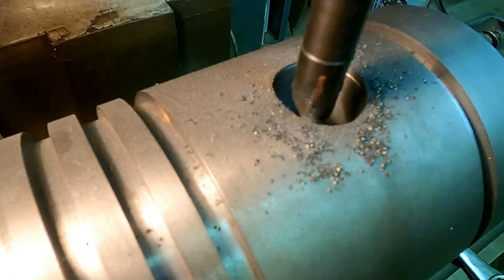That's all the time I have for this video. Got the holes, bosses drilled out there to the dimension I need. The wrist pin's not that big, so there are brass bronze bushings that go in there that the wrist pin actually rides on, so we'll be making those in the next video. But for now, I think one of the hardest operations on this piston process is behind me now, and I'm glad, and I've come out learning quite a bit about how to jig stuff up and get started, and building a lot of confidence on doing this machining.